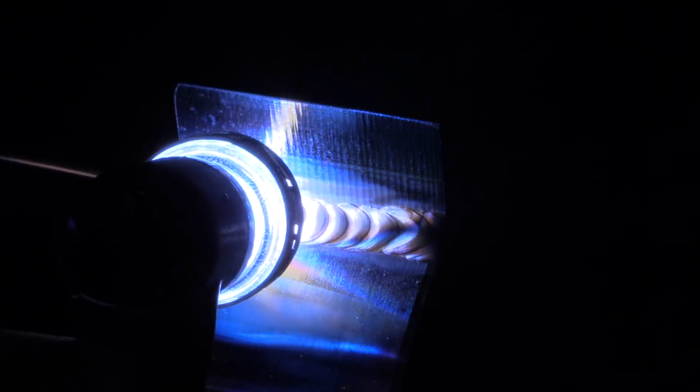Now I'm starting just about a 1/4 inch inward, because if I light up on that corner tack and it's got stress on it, it's liable to pop open, have a little gap there, and I don't want that. I'm not really too worried about this first pass, what it looks like. I'm just trying to put enough metal on there that the second pass will put the final weld size on there without having to cram rod in there.